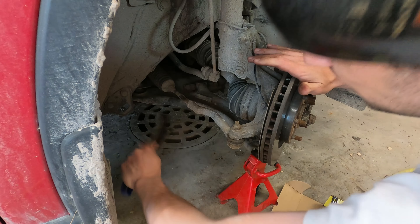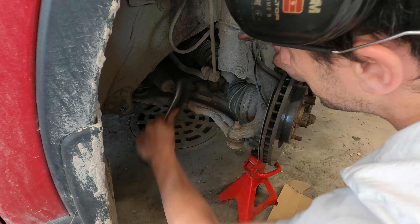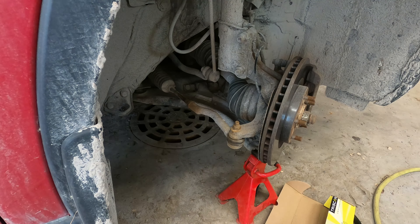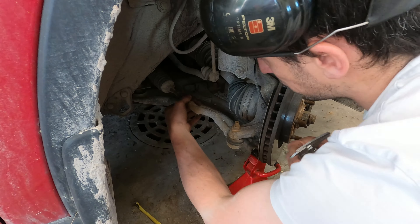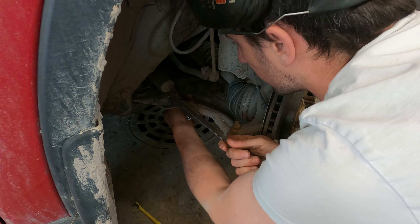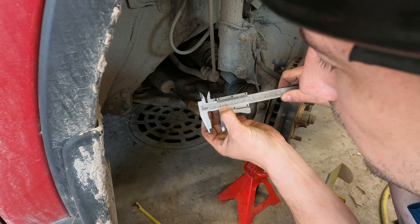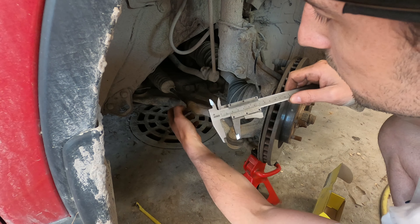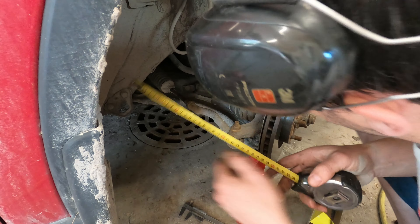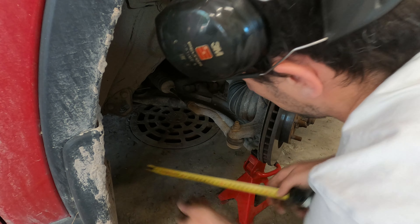Let's do some cleaning. We check the thread here on the bar — from the back of the thread to the nut, how much distance we have — that way we can reposition it to the very same distance. So here we can see that we have 17 millimeters between the last thread and the bolt. From the middle here to the last thread would be 21 centimeters, and we'll check that when I put it back.